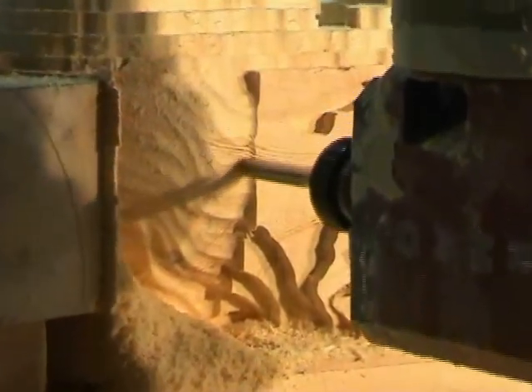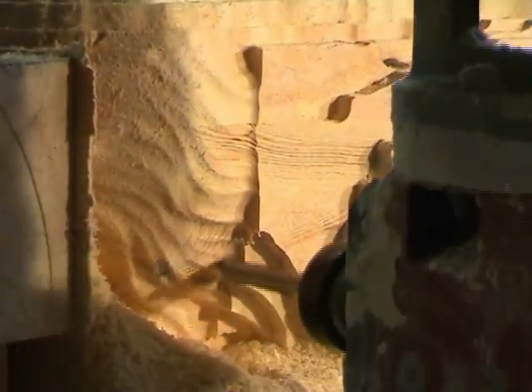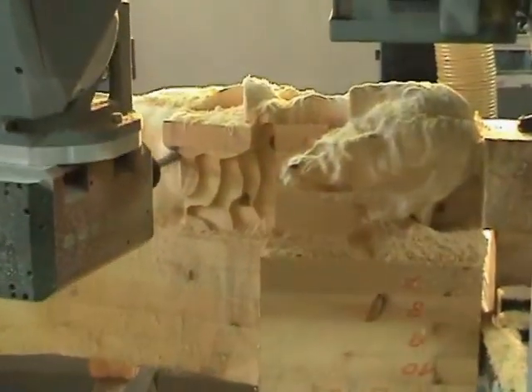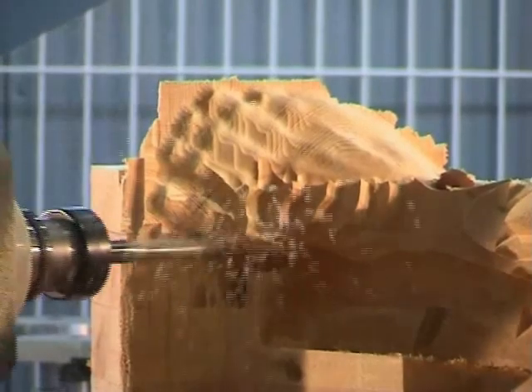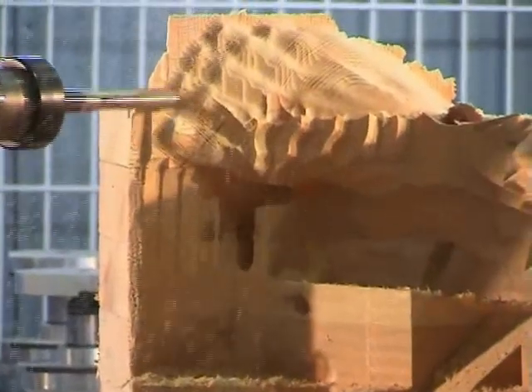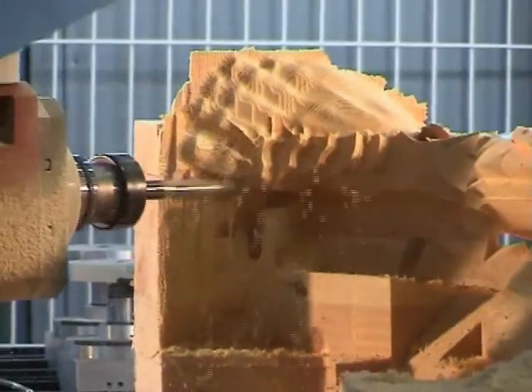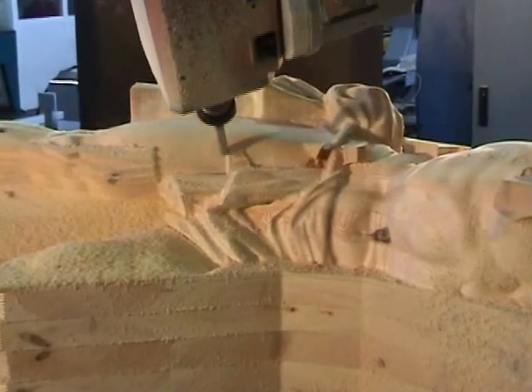This tool was a 20mm diameter ball end. The next operation was carried out using some of the many machining strategies that AlphaCam 3-D machining offers, from different orientations, again using 3-plus-2 machining. To ensure a good finish, it was necessary to machine with a width of cut of 1 or 2mm, depending on the curvature of the area being machined.